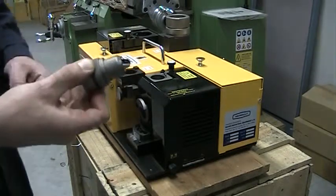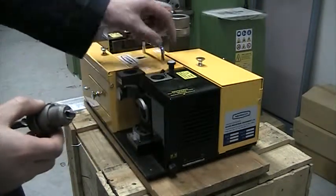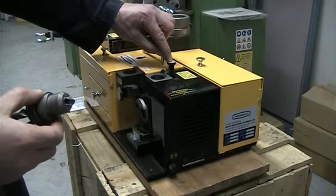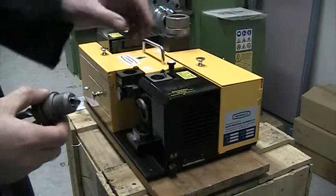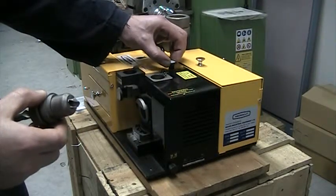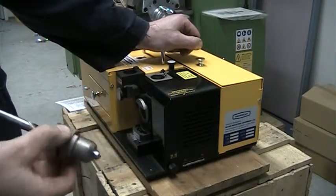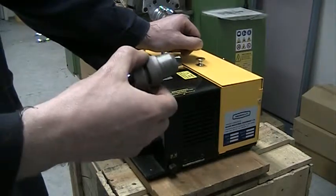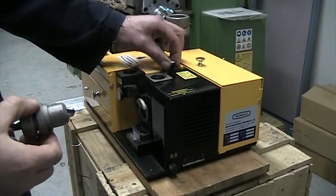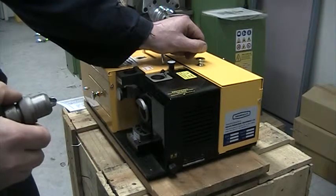And that's it — I've just ground the drill. Now, if I want to put the split point or center point on there, up here at this port, you can select the depth by turning it all the way first to the right, then counterclockwise. Zero will give you the smallest center point, and if you increase that number, it'll give you a deeper split point, or center point. The deeper the center point, the longer it will last, but the tougher it is to drill if you're drilling by hand. A smaller number gives a smaller split point, easier to use, but you'll have to resharpen it sooner.